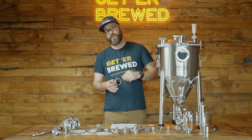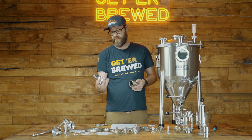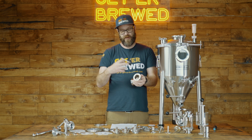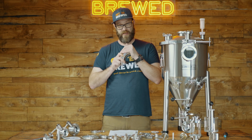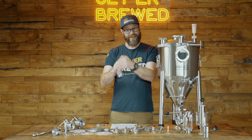Another thing is the versatility. You can get plenty of fittings that are going to fit onto your different tri-clamps. You can get reducers that are going to go from a two inch to a one inch, and a range of other different products. For instance, here's a nice gate valve — put those two together, sorted, and you can fit other fittings straight onto this. Also, the way it's been designed, it's leak resistant with this little rubber o-ring. Once that's secured in place and you've got everything tightly done up, you're not going to get any leaks.